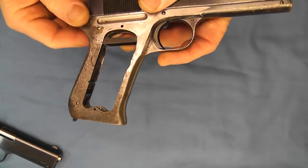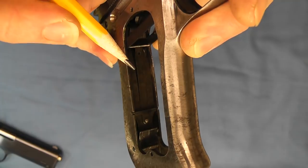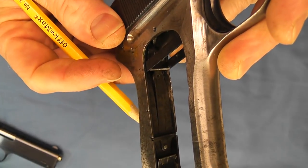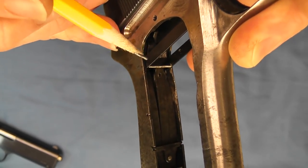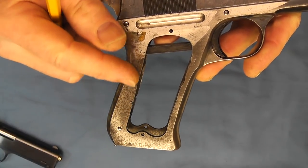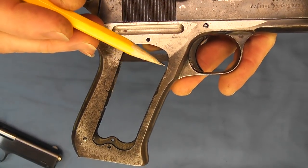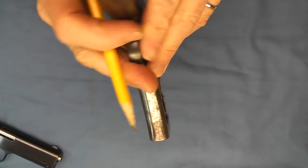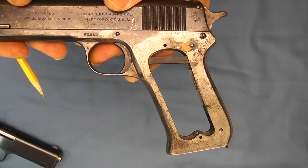Being a work in progress, there are several things going on with this. I'm going to bring this up so you can see the sear spring here — you can see it just doesn't reach the back of the trigger. This little hole right here is where it's supposed to catch a notch on the back of the trigger, but this has been elongated a little bit with the increased angle and it doesn't quite catch there. And you can see that it's not as perfect as the machining in the other one — this was clearly a work in progress.